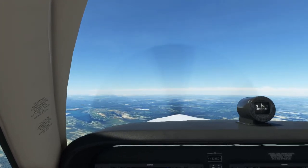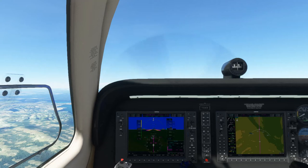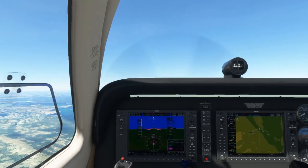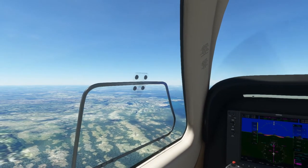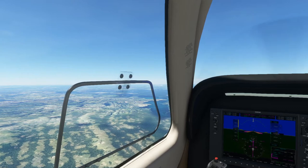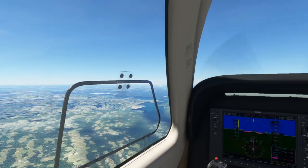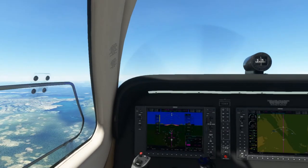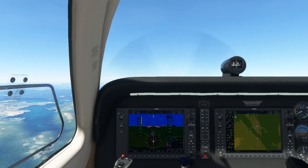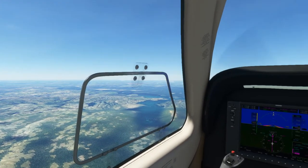It's gonna be awesome. When are you hanging drywall in that place? Well, I gotta frame it first. You got the framing in there for the studs, right? No, just like you saw, it's just the 2x2s on the concrete with a 2x6 on the bottom. I've got a couple more to go to bring it out to each edge. I'm going to have a 2x2 on each far edge, and then it's just a 2x4 frame on the east wall, and also on the south wall, just inside the beam. So I think I'm putting a 2x2 up as an anchor at the top, and then putting a 2x4 into that, and then hanging the drywall there.